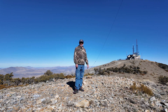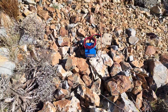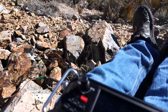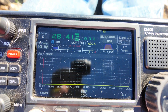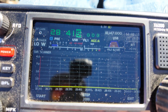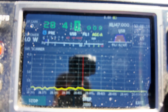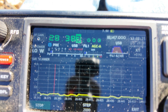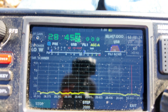Now that it's set up, let's do the real test — some sweeps. Let's start on 10 meters. This is my very first time. I have RG316 connected over to that antenna for testing, and I have the Chameleon RG316 with the choke on this end. The auto tuner is off — nothing is happening here. 10 meters is looking pretty good across the band.